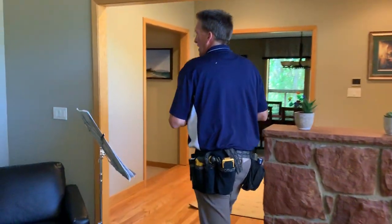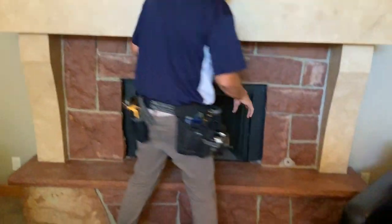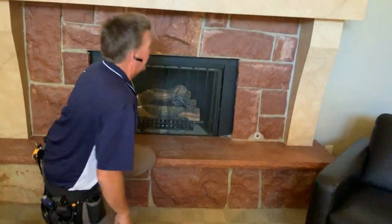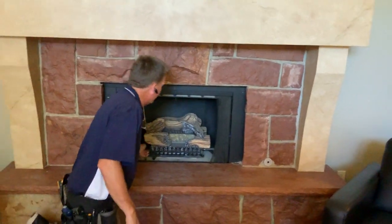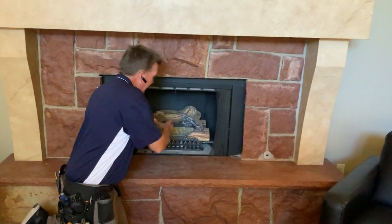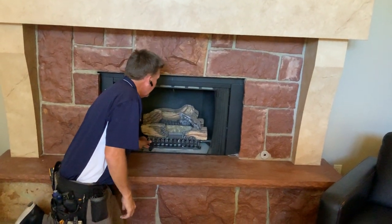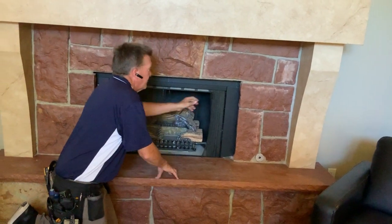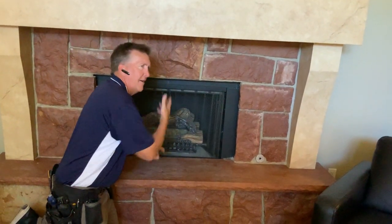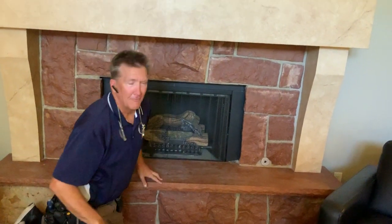Okay. Cool. Your fireplaces, two of them have these gas log type. These aren't allowed anymore the way they're currently configured. Now you have to turn the valves inside the box. Nowadays they want everything outside the box or with switches. They didn't secure down any of the grates, and they didn't put any damper stops on the flues so that all of your heat goes on up, even when it's not on.